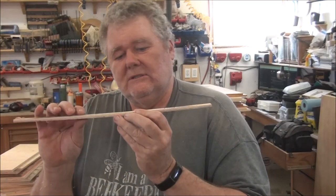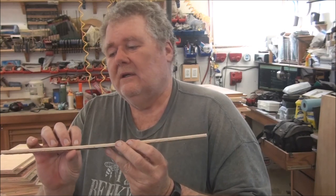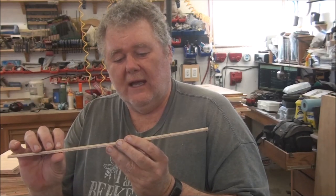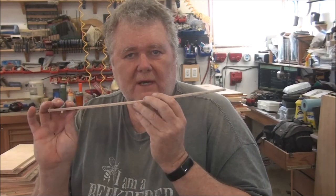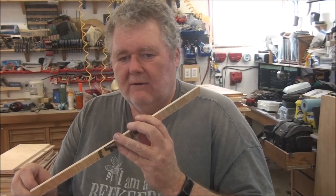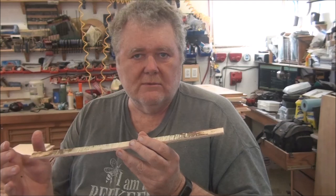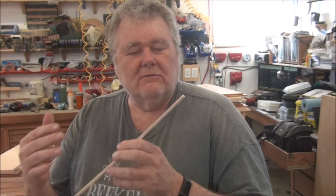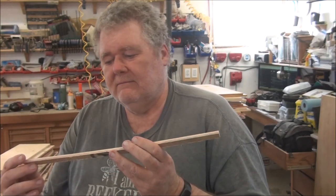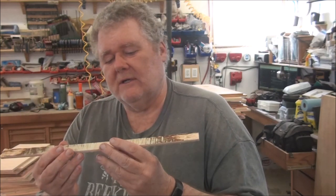And the reason I show you this is a perfect example of this. And this shows me where this plywood is wet and where it's dry. This shows me that the plywood is wetter on the outside than it is on the inside. Wetter by what comparison? Wetter than when it was manufactured. I'm only assuming that perhaps every lamination was the same moisture content when the plywood was put together in the factory. Maybe that's not a safe assumption, I don't know. But I think probably it is. I think they've probably got that covered.